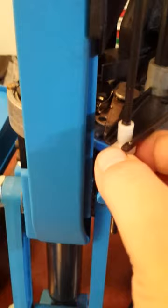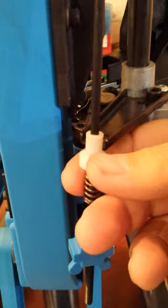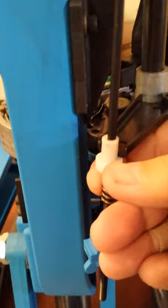If this is all the way down and you try to pull it out, it's stuck in there. While the bushing looks like it should be able to slide through the slot, it does not — it needs to be inserted from the bottom, pushed up into this little hole. A lot of people, when they go to remove this bar to empty the powder hopper or move things around, will unscrew the wing nut. But the problem is, once you have this set correctly, you never need to touch that. All you need to do is lift up on the ram and everything comes loose — this just sits in here and can pop right out. You can remove the bar as needed, it just swings there. A lot of times when you look at this you'd think it sits here like this and you should be able to push it through that slot, but it doesn't work like that. The only thing that slot is for is for moving this bar in and out.